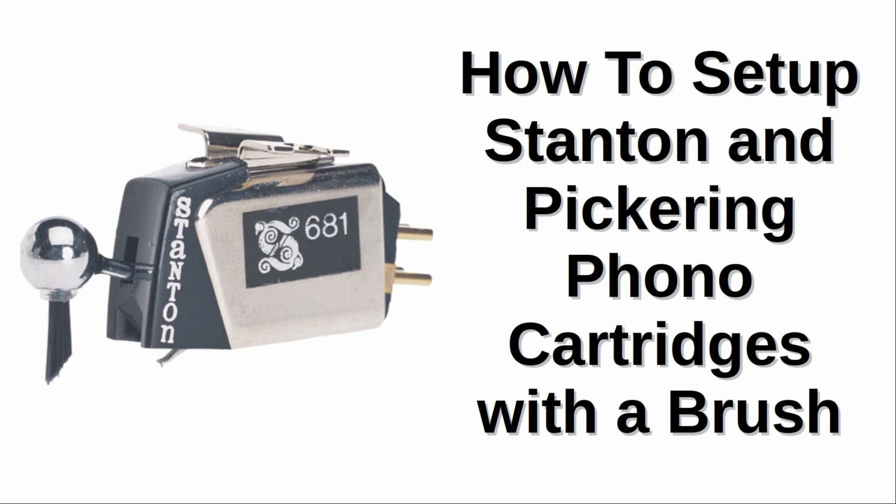The problem that I have with my cartridges, and I have a Stanton 500 and a Stanton 680 right now, the styli themselves don't seem to be all that bad, but the stylus is not working with the cartridge electrically. The magnets all seem to be way too powerful. They have too much flux, and so what they end up doing is overloading the coils in the cartridge and creating a lot of distortion.